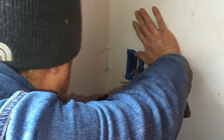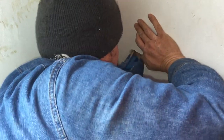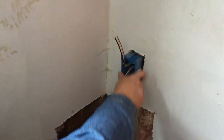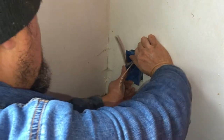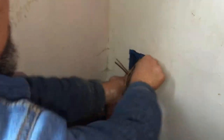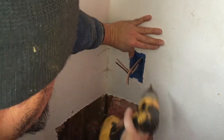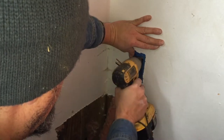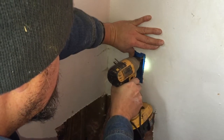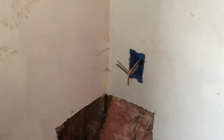This is an extra deep box, and the only reason I'm using it is it's all I currently had with me — trying to save money, not going to the store. Make sure it's square. This is where, because the drywall is sensitive around these areas, the fact that I've tested these tabs matters. You don't want to tighten them too tight — you can tell as soon as they start to grip.